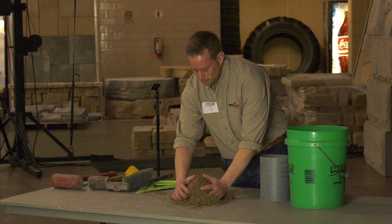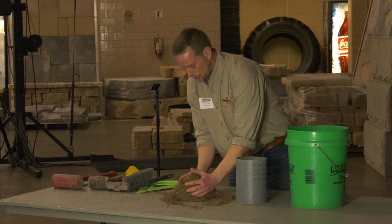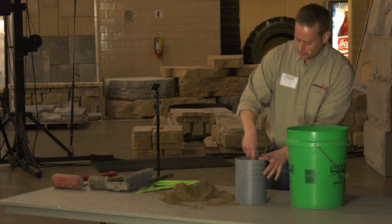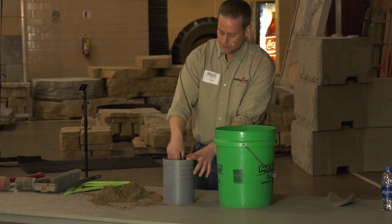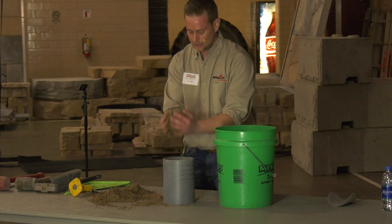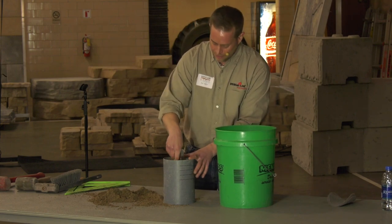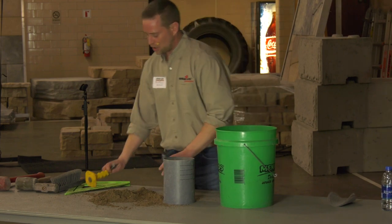So we saw that if we don't backfill, we end up with an immediate failure — it returns back to slope with just a tiny bit of load. So now what we're going to do is introduce backfill that's also got a level of compaction to it. We're using the proper size compaction equipment for the job, and we're compacting in lifts of about an inch because that's all this thing is probably going to be able to compact. We're scaling our equipment to fit the job requirement.